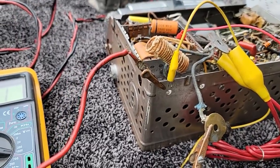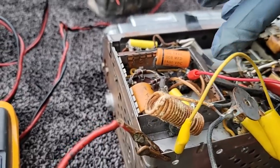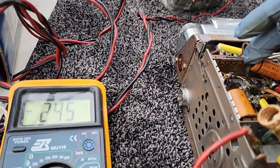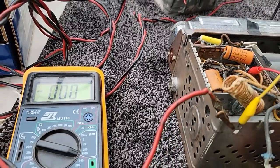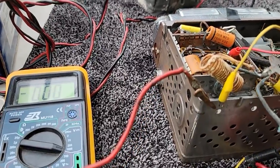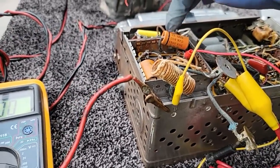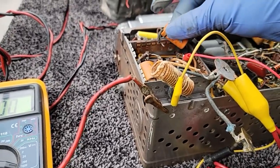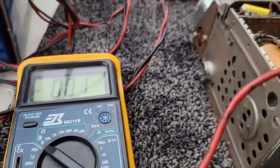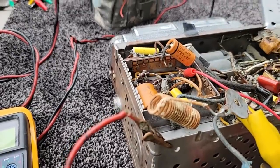I think I may have discovered something by accident. I was tracing wires and this capacitor broke loose. I'm measuring B-plus — it's zero. I lift this capacitor out and it goes to 245 volts. You don't want to run without that capacitor because it keeps the points from burning in the vibrator. But is this sucker shorted? Is this what's killing the B-plus? This capacitor is, in fact, shorted — totally shorted, zero ohms.